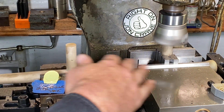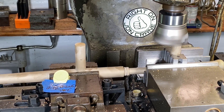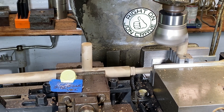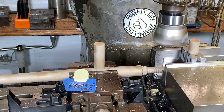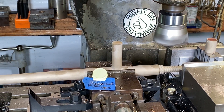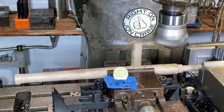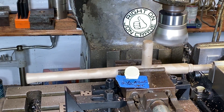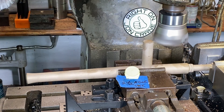As I come across here, I can tell my head needs to be trammed in a little bit - I think I'm skimming like another thousandth off on the back end. I'll come right across to this one. Sometimes when I've been milling these and they're a little higher, I have to drop the table down so I don't take as big a cut. That one is a little bit high there.